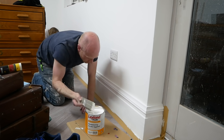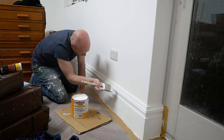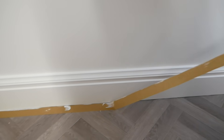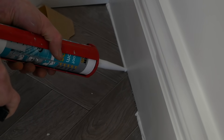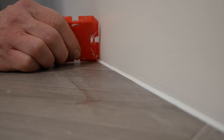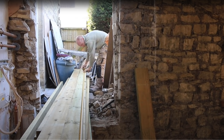So we decided to make a date of it and spent the evening getting all of the painting done, all of the final touches, so that the room was almost ready for all the furniture. The very last thing we wanted to do was just to seal our skirting boards to our flooring — that will make up for any slight variations in that join between the skirting board and the flooring, neaten things up, and more importantly make sure that any spillages or wet shoes or boots or a bit of rain coming in the door — there's no risk of that getting in and getting trapped, especially with this being MDF skirting. Tell you what, for £140 super-budget vinyl, some clearance MDF skirting board that we've been hoarding, and what was just a tumble-down asbestos-covered garage — this room is looking alright. Quite pleased with it, to be quite honest.